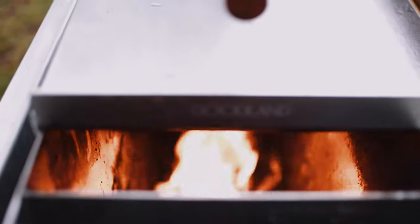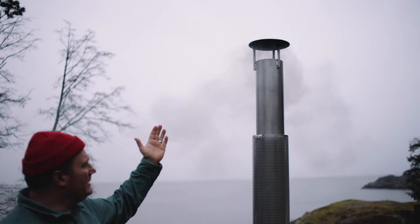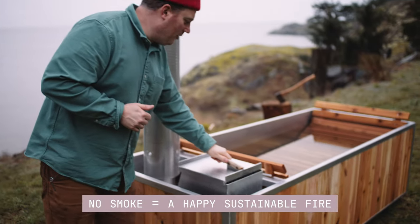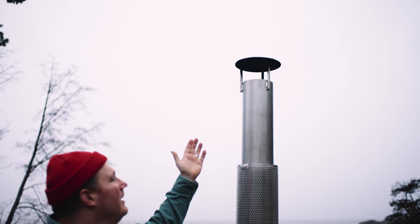When you're operating the wood-burning hot tub you should have almost no smoke coming out of the chimney. If you have smoke like this, it means that you're not allowing enough air into the firebox. So all you do is just slide open the lid and allow a little more air in there. And this is what it should look like when it has enough air.